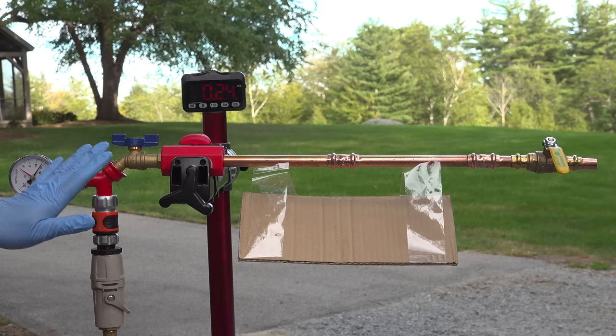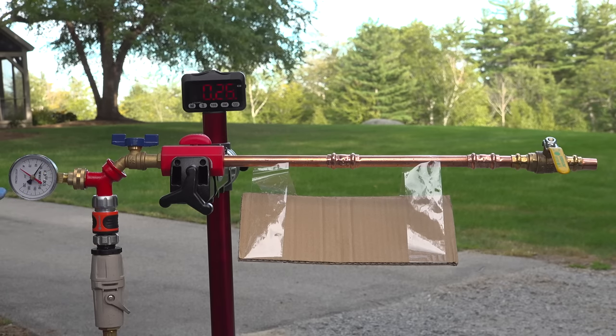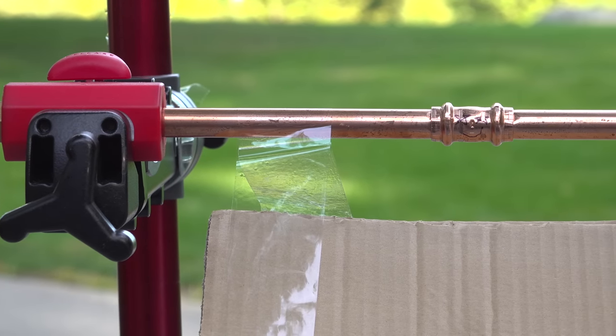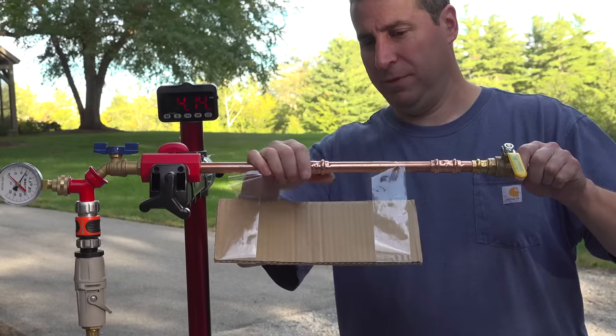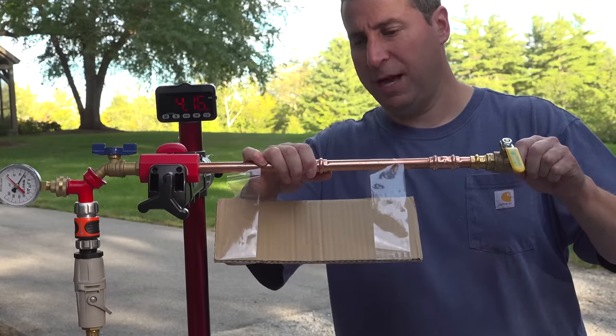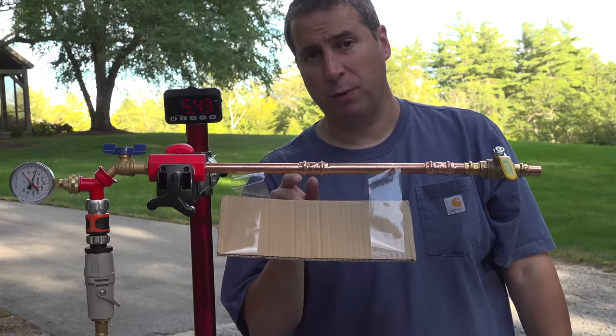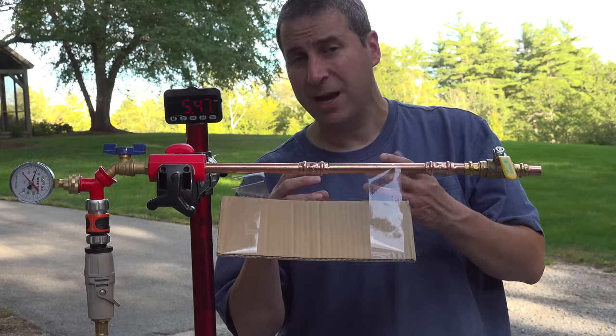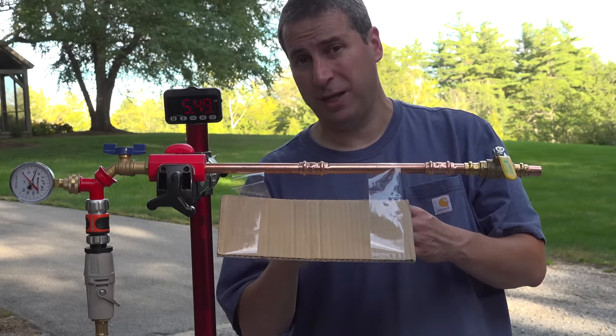I'm not going to shut off the water supply. I'm going to leave it exactly as pressurized — right now I'm at about 58 psi. You could recreate this test; I didn't do anything special. I took the o-rings out, crimped the fitting, and there are no leaks. You can't really move these anyway — they're so tight when they're crimped. Now this would never work with a SharkBite, because SharkBites don't have any ability to compress the fittings — they are truly sealing just with the o-ring.